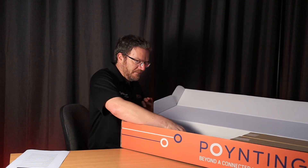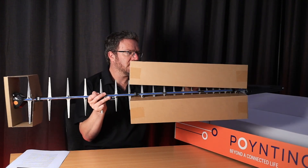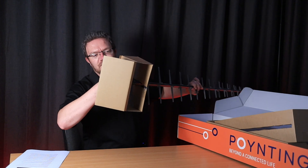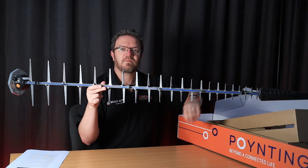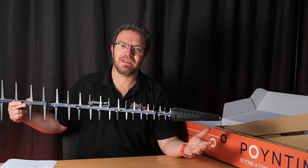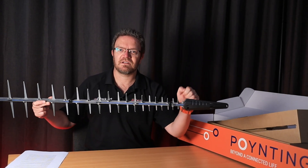What's in the box is the antenna itself. There are some brackets, and support bits on the antenna on the front, bottom, and back that get removed. A few things having this in my hand that are different from the previous generation — starting with the nose, which looks quite different. It has a protected piece, because for Wi-Fi 6E or going up to 7.2 gigahertz, you need more finesse in the design. Because it's more delicate, it's protected with a radome, giving you an ultra reliable rugged antenna structure.